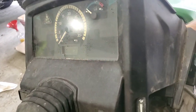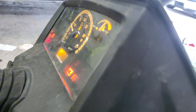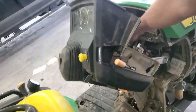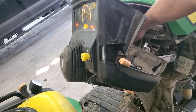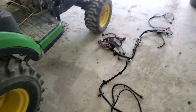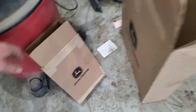But I have another issue with this too, which might have taken the dash out. The key is on, but if I wiggle the wiring just right up here in the loom, it'll bring the dash back on and off. So I do have a broken wire in there — that's fairly evident. Due to the age of the machine and it breaking in the main junction of the loom, I found it pertinent to go ahead and swap out the entire harness.